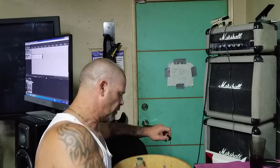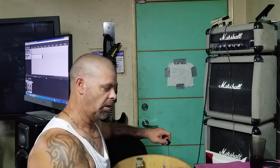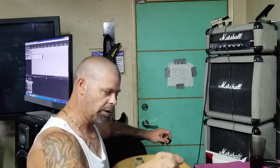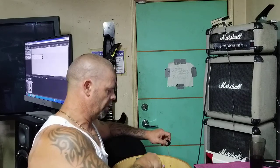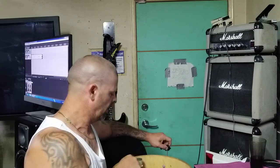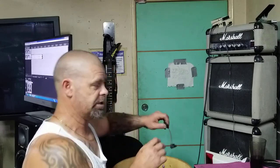This way it's easier to assign your velocities and all that sort of thing, because usually a Roland would have one trigger in the center. That would mean if you hit it right in the center, you're going to spike — it can blow your earphones or speakers. But when it's placed off-center like this, you've got all of the area around here that's going to be velocity-assigned.